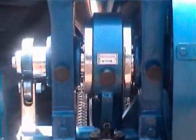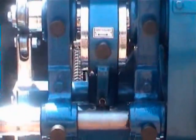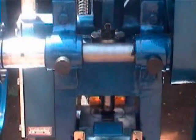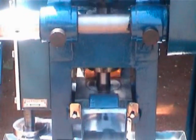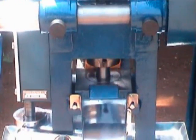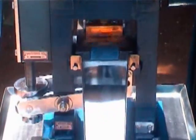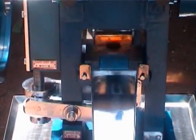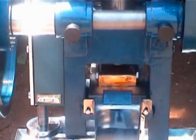You are seeing the eccentric cam in motion. As it goes down, the lower punch comes down, the upper punch is being fed with the feeder, and it is ejecting the tablet. The feeder is also ejecting the tablet. The tablet ejection system does the work of bringing the tablet compressed, bringing it up, and the feeder pushes it out.